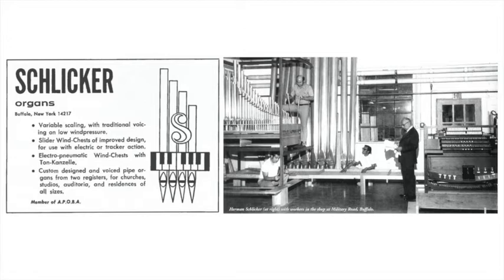And after this is done, then we set the pipes on the voicing table, and this is done most importantly for just tuning. We have to tune these pipes then against the rank back here. The pipe is a little fuzzy, and it's loud also, so we'll just go ahead and make the wind way a little bit narrower. The pipes don't have to be this loud. Sometimes you try to push them too far and you end up with a very bad tone. It's better.